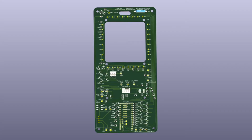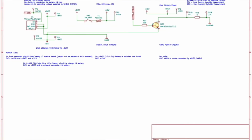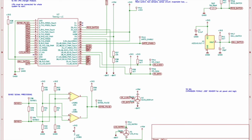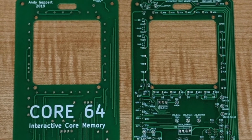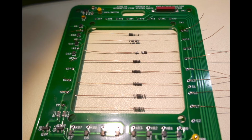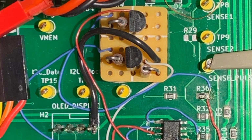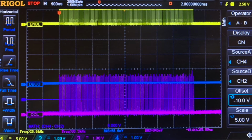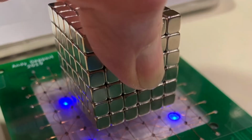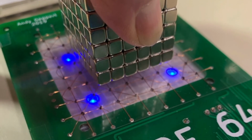The first formal prototype is this single board design in the classic green solder mask. This was also my first complete circuit board design project from concept to prototype. I used KiCad and a great tutorial series by Shawn Hymel and DigiKey. This prototype runs smoothly with all 20 of the matrix drive transistors directly connected to the Teensy LC I/O pins. I maxed out the available I/O and even had to overlap some of the functions by sharing pins.